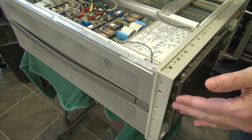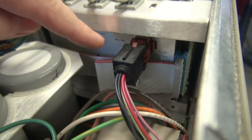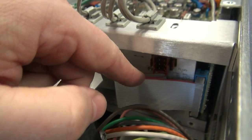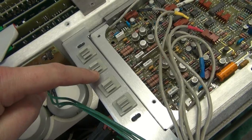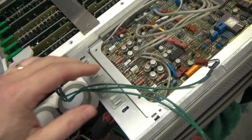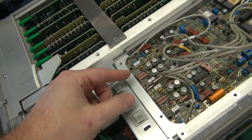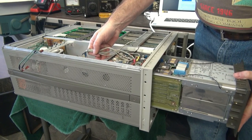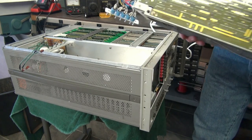It's going to come up from the front. I'm going to stop here because I need to guide the cables — but we're almost there. Here's the back side. There's a six-pin connector here that you pop out, and there's a ribbon cable. Make sure to get those out before you pull it or you're going to damage it. There are retaining clips for the cables — just push down the triggers and they'll pop up. I have the rear controls disconnected. These cables went to the plugs up here, so I'm just going to pull them and leave them there. And here she is.